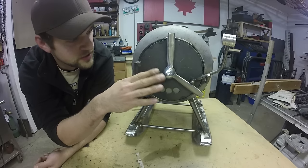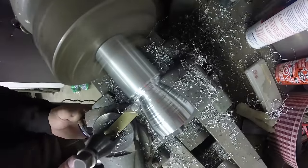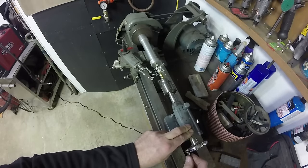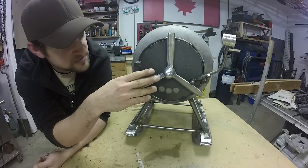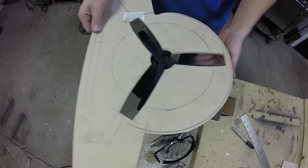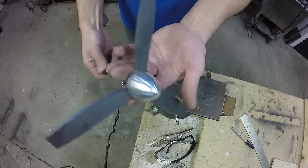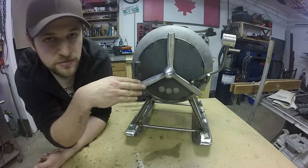The cone and the prop are all handmade. The cone itself is just made from a piece of aluminum stock, and I worked it on my little lathe to get a nice cone shape and then polished it out. I also drilled a hole in the back and threaded a rod into it. The prop is plasma cut out of 3/16ths plate. I used wooden templates to do so — if you want to check out how I build those templates I have a video on that. After some grinding, polishing, and cursing I got the prop into a shape I liked.